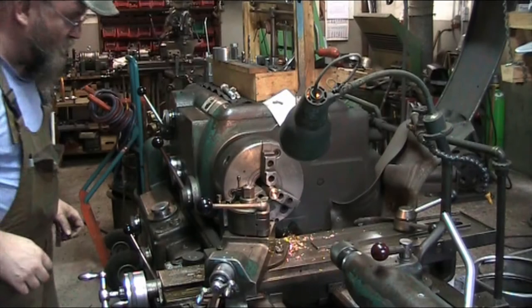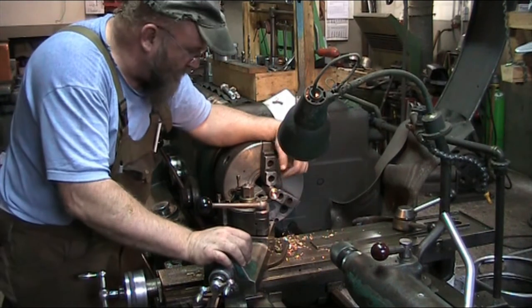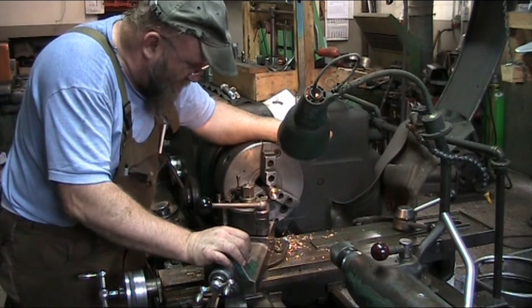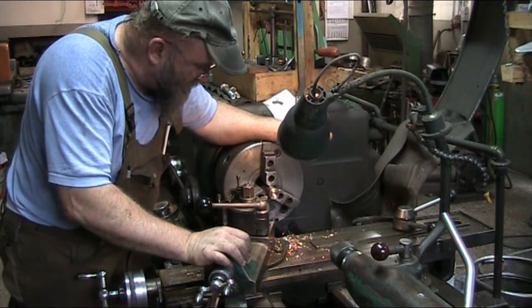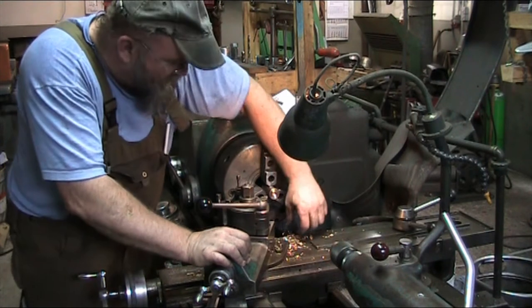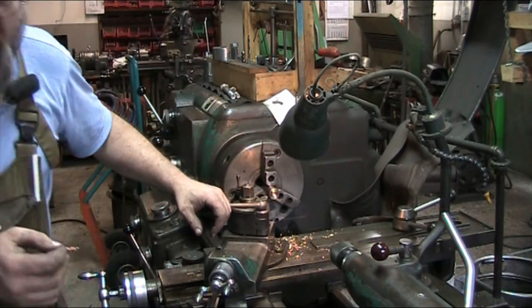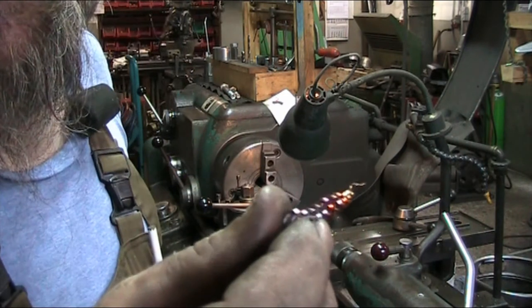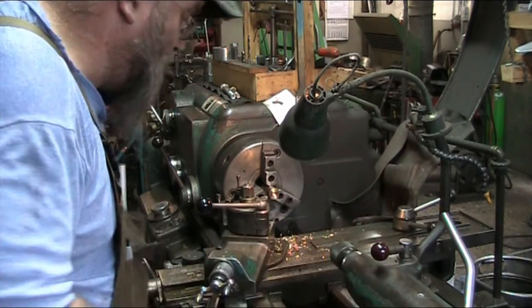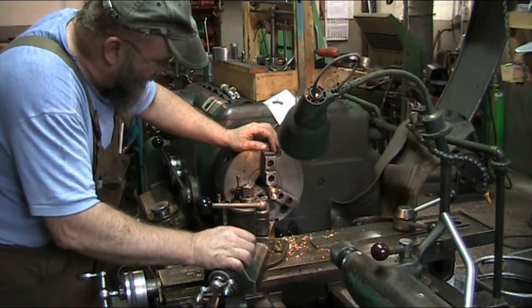Well, YouTube, from the looks of things, this is going to work out pretty good. I started going ahead and turning one. My material's getting a little hot, so I'm wondering if I might want to run coolant with it. I don't see what it would hurt. By the chips here, we're getting a beautiful rainbow color. Now, this stuff is machining absolutely fantastic. As you can see, this is a bronze, a tin bronze, and I've never seen anything machine like it.